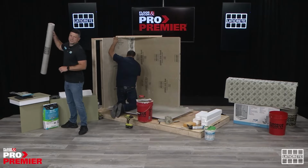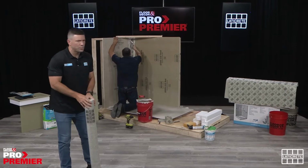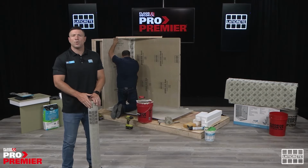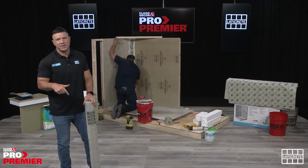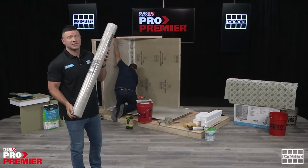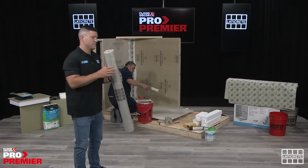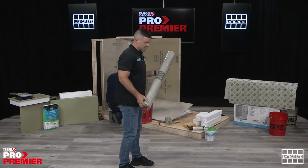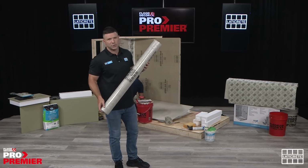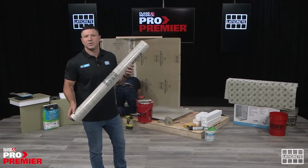While we're still discussing sheet membrane, another thing I neglected to include when I referenced the kits is that a roll of sheet membrane will come along with it, in addition to the pre-cut floor piece. If you're choosing to use cement backer board, this will allow you to waterproof that backer board directly out of the box. The size of the roll varies by kit. You can check our website or the Floor & Decor website for more details on the exact sizing of the roll that comes with each of the corresponding kits.